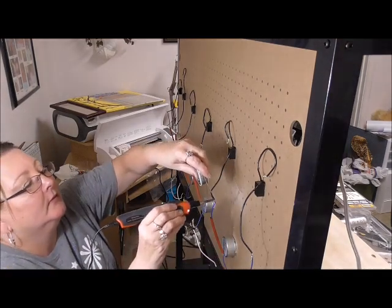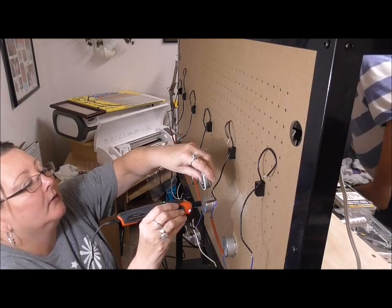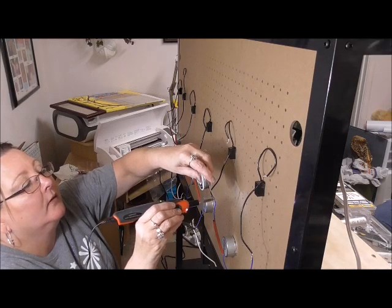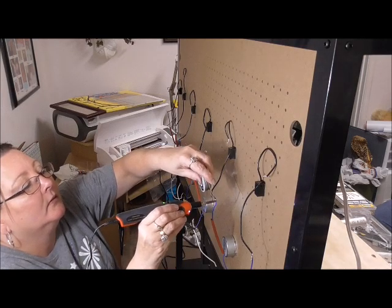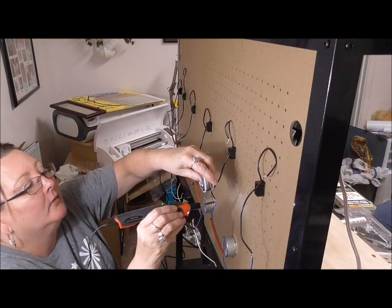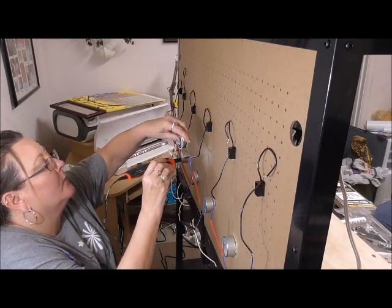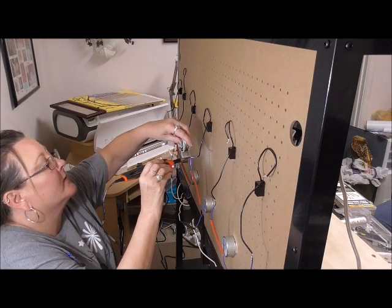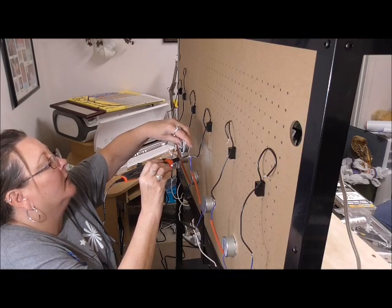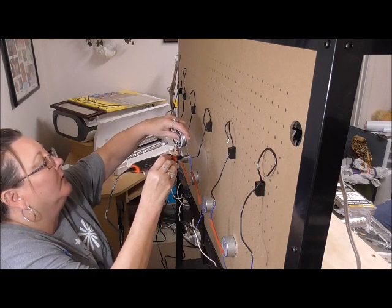All right. So, touch it to the wire. Make them all just look like that. If it drips, don't worry about it. Touch the solder to it. Just don't let it drip on your leg. It's stuck. So I'm touching the wire, and I'm getting the wire hot, and then I'm putting the solder on there, and then I'm touching the solder, not necessarily to the soldering gun, although it might.